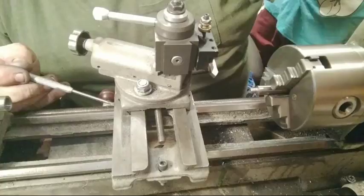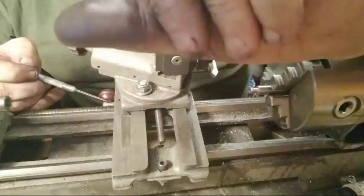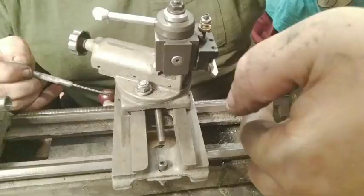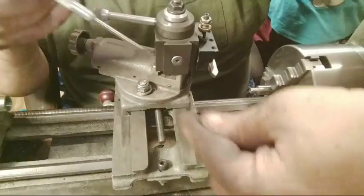This right here was down too low, so the half nut wouldn't engage. You know, because the half nut is basically, y'all know how it's made. It's a long piece, and then they thread it all the way through straight, and they cut out half of the bottom on one end and half of the top on the other end, and then everything in the middle, and there you go. You got one piece over here, and then one piece over here, and when you come down, you're like this. So I had to space this up.